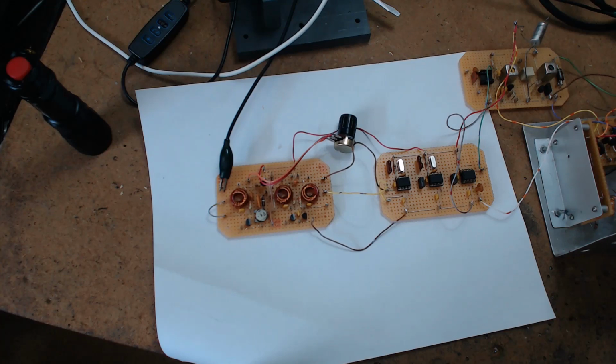They're junk. And if you read the reviews on Amazon, any model, half of the people figured out this thing doesn't work that good. One guy will say he's using a hand scanner, and it's deaf compared to his hand scanner. That's right, your hand scanner has an RF amp with some coils in it and filtration on the front end. SDR gets all these different frequencies, but there's no front end. It's just wide open. And if you put it on FM, it works great.